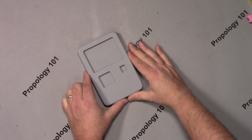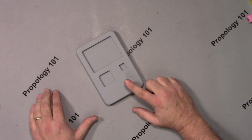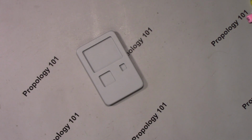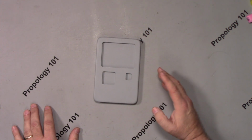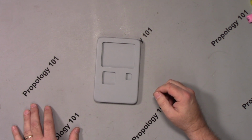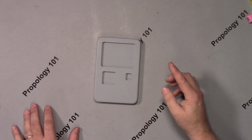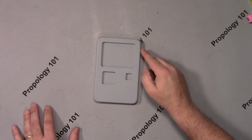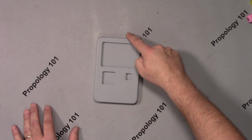Now, during Next Generation, 99% of all the pads we made were made by hand out of sheet plastic, either out of acrylic or out of styrene, but it just really depended. And at that point, there really wasn't options to make these pads like there are now. Right now, you can go into almost any shop nowadays and find that they have a laser. So you can laser cut each and every layer very precisely, and then you still have to round the edge, but you can do that with a small router. Even a Dremel with a router bit will do this rounded edge here.